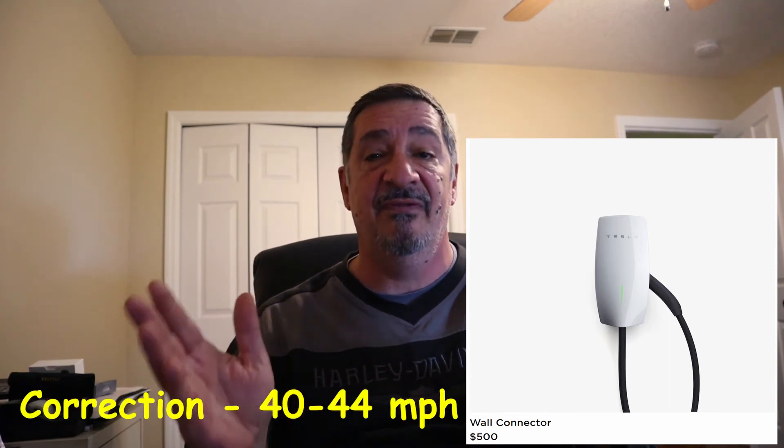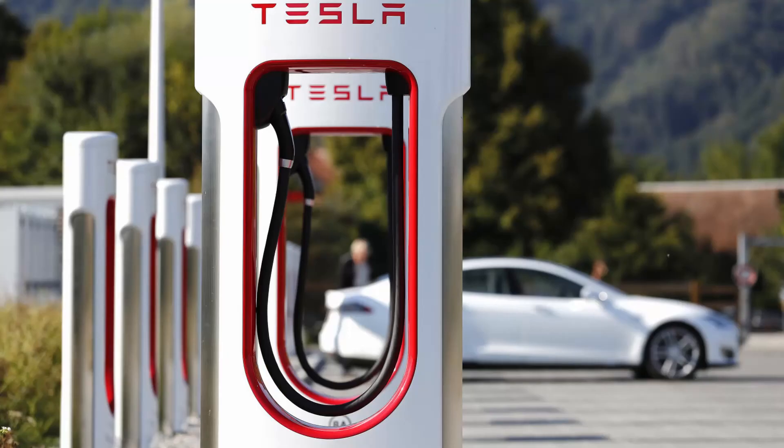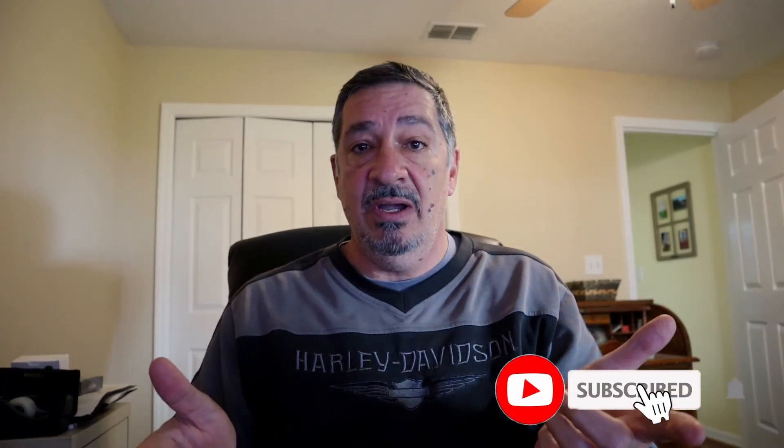There's also a more expensive option: if you have a 50 amp breaker — or it can go up to 80 amps — you can purchase a $500 Tesla wall charger. With a 50 amp circuit that'll give you about 30 to even 40 miles per hour if you have an 80 amp circuit. And of course, this is a home charging options video, but there are always superchargers all over the country you can use at any time. If you use my referral code in the link below when you purchase your car, you'll get 1,000 free miles of supercharger charging. I hope you enjoyed the video and found it helpful. If you liked it, please like it, subscribe to my channel, and leave a comment for any other videos you want to see. See you next time!